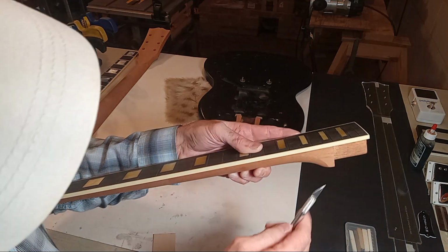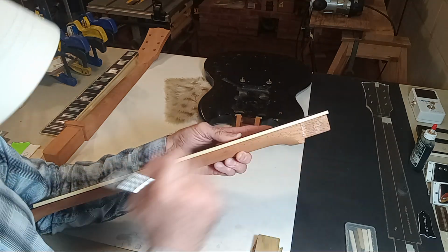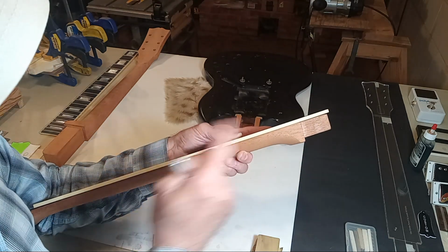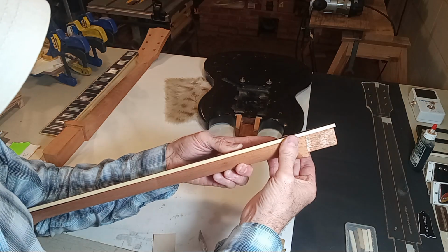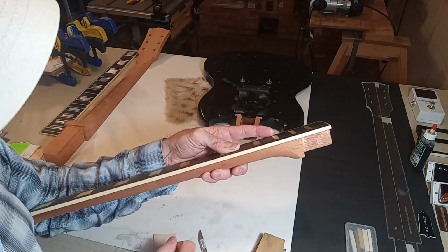But please understand, your nitrocellulose lacquer, especially if it is tinted with color, if you spray 7, 8, 10, 15, 20 coats of that, I can assure you there's a mil thickness there, and it will start filling in. Again, please read between the lines. I'm talking about just barely being able to catch your fingernail on the overhang.